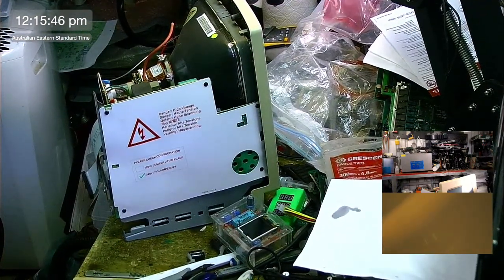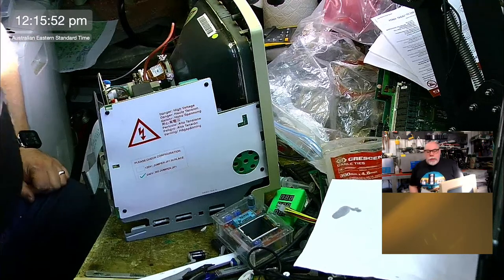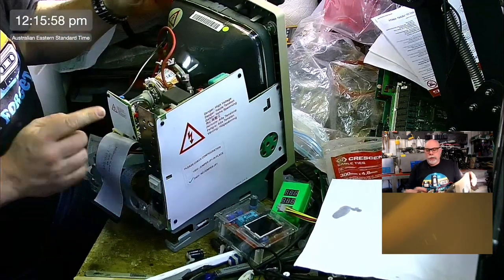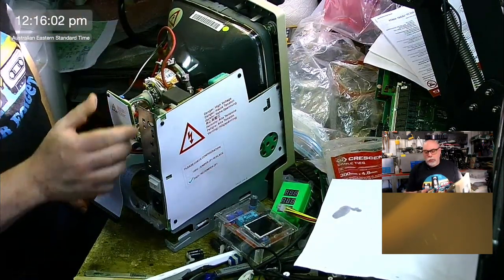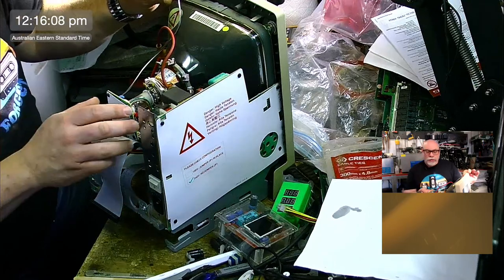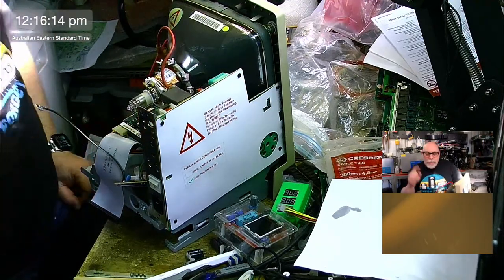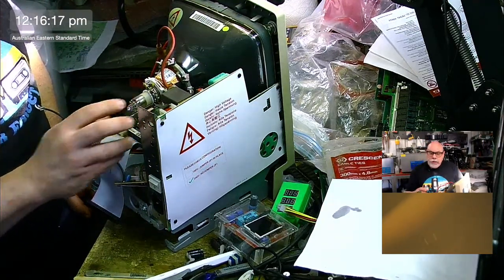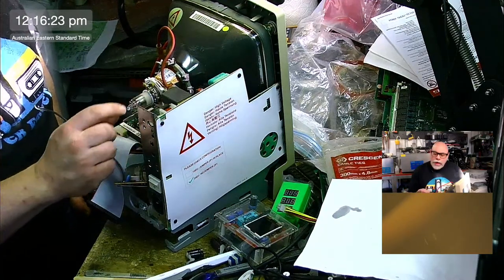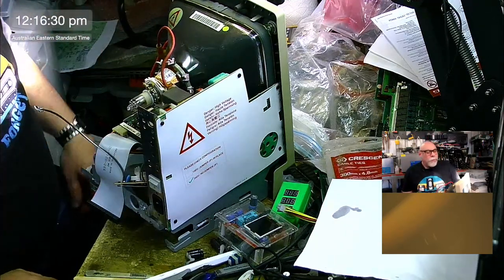Okay, righty. So, as I was just saying, the Macintosh Classic was a budget computer. One of the things that this doesn't have is a connector to remove this little neck board. So this neck board is hardwired onto this. You need to undo this screw, this grounding wire. Don't forget to put it back when you're doing this, by the way. Then you take the neck board off, leaving this incredibly exposed. I'm actually seriously thinking about 3D printing a protector that I can slide on when I'm working on the board. It'll slide onto there and protect this little glass nipple on the end here, because all it takes is a decent knock like that and you're gone, which I have done before.